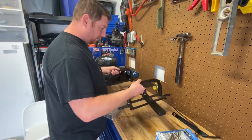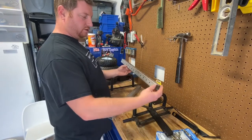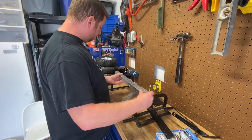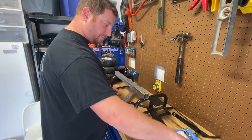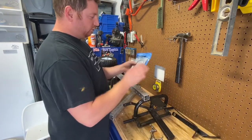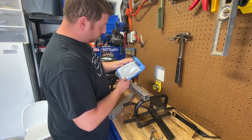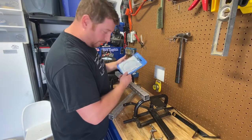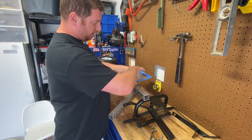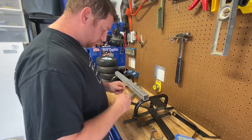Step one is going to be to mount these two pieces together. I have some pieces of strut aluminum here and some bolts, and we're going to bolt them together. Then I purchased from Lowe's this Lazy Susan turntable, and it's rated for 400 pounds, so I think I'm covered here. We'll mount this plate on, and then we'll find a way to mount the seat onto that plate, and then we'll be able to spin. So that's the idea. Let's see how it goes.